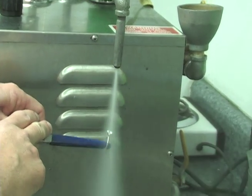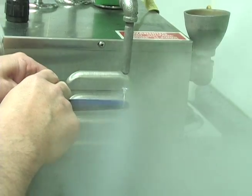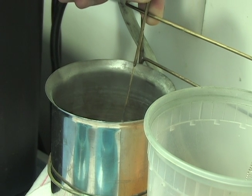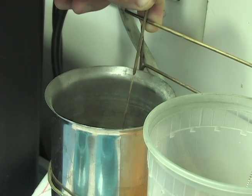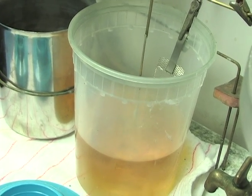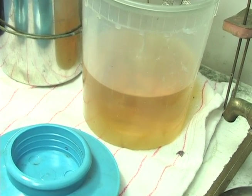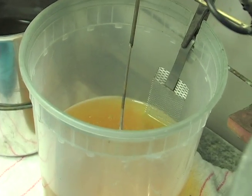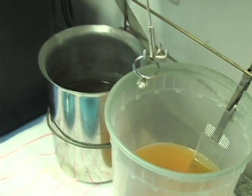He first rinses and steam cleans to remove all impurities. Next, he uses an electro cleaner to remove any further oils or minute mineral deposits. After being rinsed and dried, the ring is submerged in a rhodium plating solution with 6 volts of DC current passing through it, creating an electroplating process that draws the rhodium onto the ring for a strong bond.